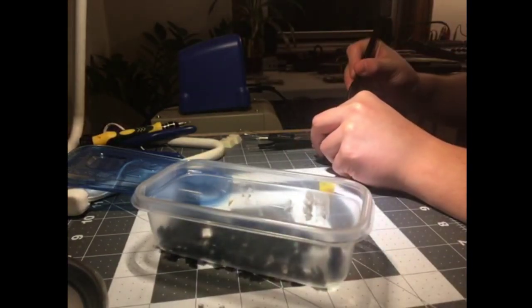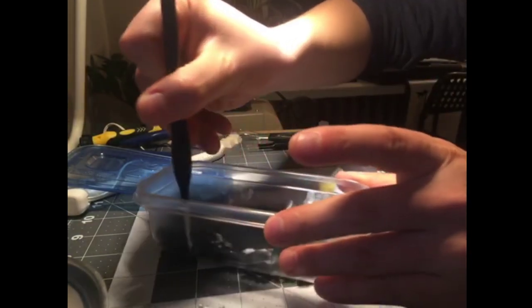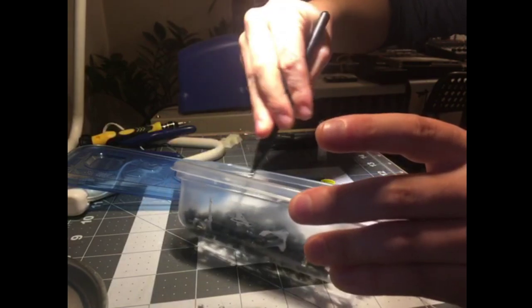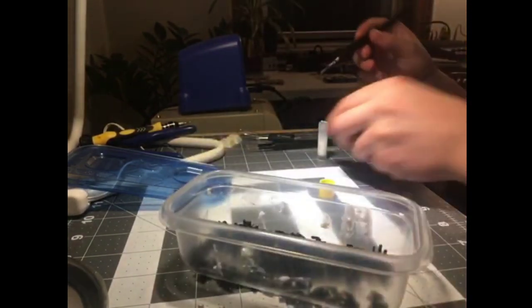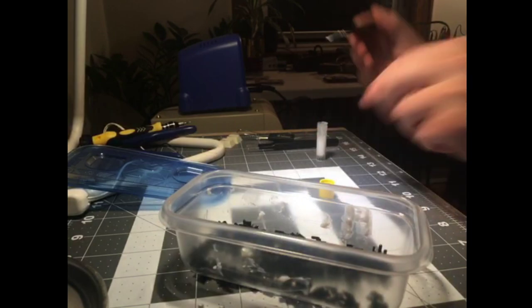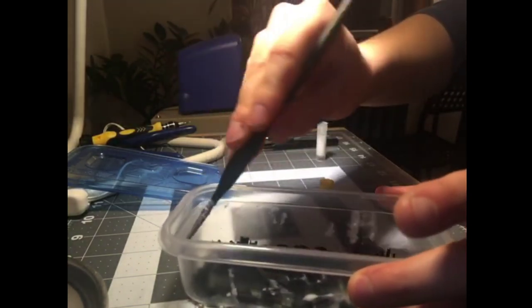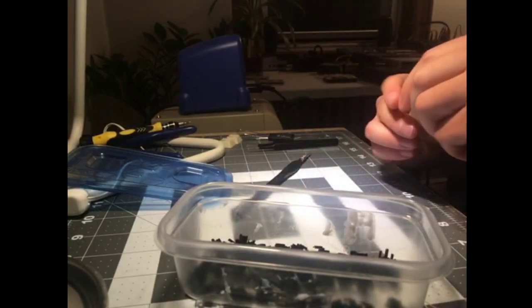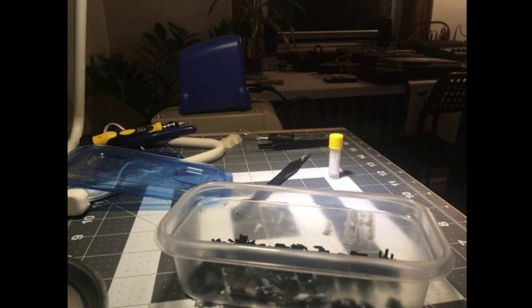I think the first person I saw do this was I Am Me, You Are You, and my mind was completely blown by it. It was like, wow, you just saved me hours of time. I'm going to go with a little too little to start, just to make sure I have the coating right, and I don't want to overdo it. Tub-lubing 3204 on MX Browns might be a little aggressive. I would do it with 104 or 3203, but they might just feel like linears. Just fair warning.